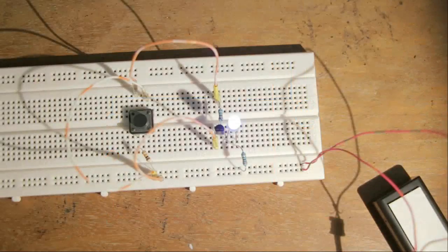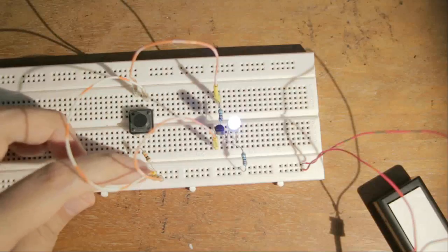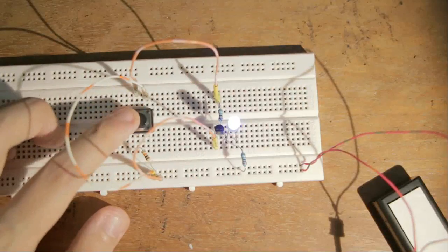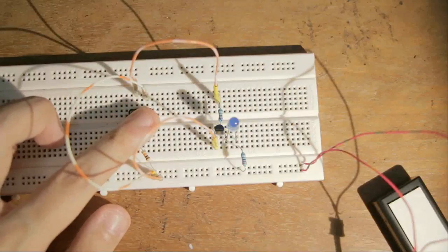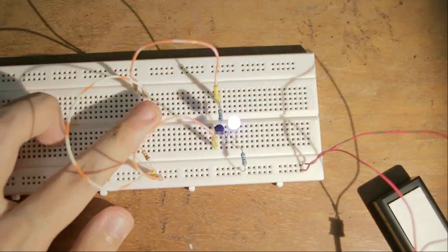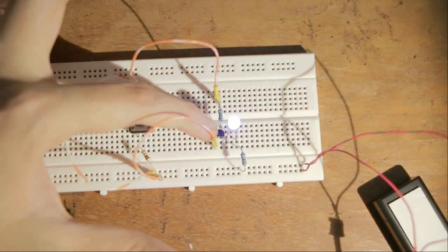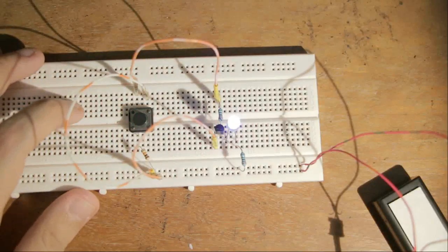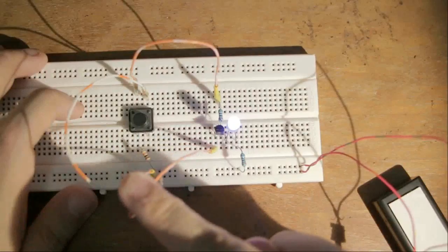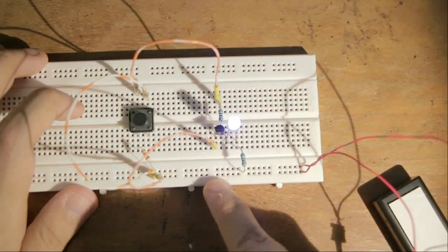Alright, our first breadboard shot of the day. Now, as per the schematic, I have power and ground coming in over my actual rails. The switch is here, and that will control the LED. Since this is supposed to be a NOT gate, it switches off when I press down on the button. Here is our transistor. It is a PNP transistor. In terms of its connection, the emitter, which in this case is our input, is just connected directly to power along the lower rail here.